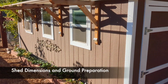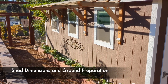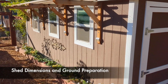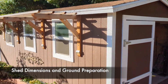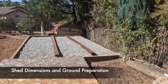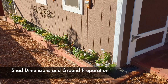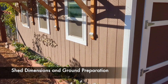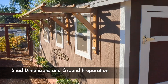Here are some shed specifics for you. The dimensions of this shed are 20 feet long by 10 feet wide. The broad side of the shed faces east and west, so I get a lot of morning sun over here on these three windows. Fortunately the afternoon sun is shaded by my neighbor's pepper trees. It's sitting on a gravel base approximately 24 by 12 or 24 by 13 — three-quarter inch gravel or crushed stone that I had trucked in. The shed itself is sitting on three massive skids with a plywood base framed off those skids.